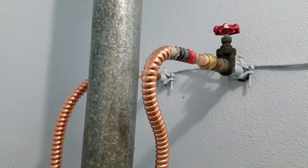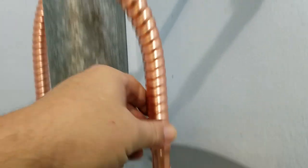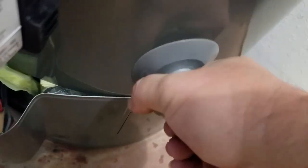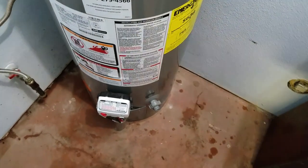So we have the cold water inlet plumbed. It's not quite as nice a bend as the other one, but that's all hooked up. Now I'm going to make sure the valve is shut — they shipped it shut. We're going to tighten this up a bit and then I'm going to start filling it up. I'll take a hot water faucet in the other room and turn it on while I'm filling this, just a little bit to vent the air out. Let's do that and then we'll check for leaks.